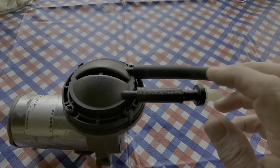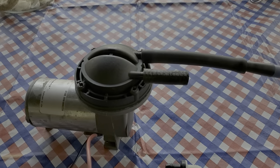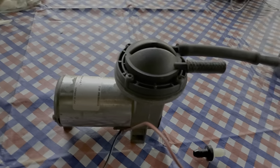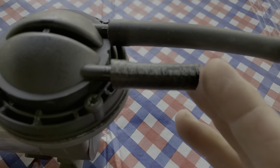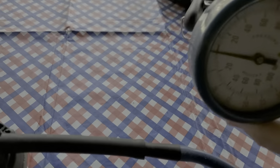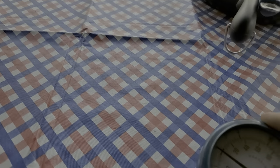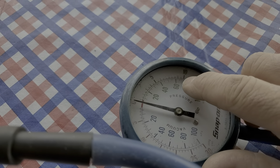What this wasn't doing was pumping air, and my flame was going like that. This is the intake, that's exhaust — it even says in and out on it. The air is coming in, but it's not coming out here at all — zero PSI. You can see five, ten PSI on the gauge.